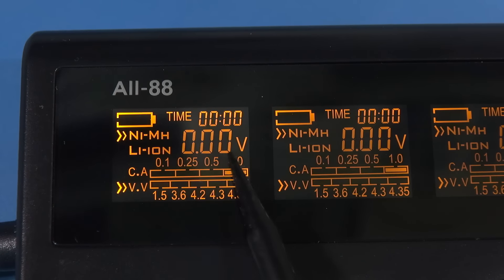There's a fair bit of latency in the way this updates. When you don't have it in charge mode the voltage level reacts quickly to the cell's actual voltage, but when you're in charge mode there's significant latency in matching the actual voltage level. I noted this when playing with a supercapacitor - when I dropped the voltage on the supercapacitor the display reading doesn't go down for a long time. In the real world that's not going to be an issue because charging means your voltage is going up, not down.